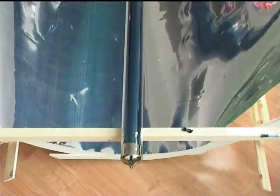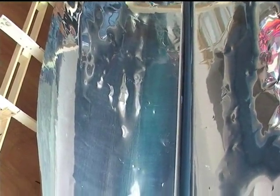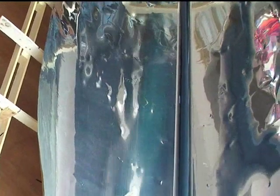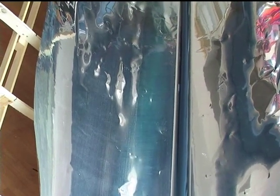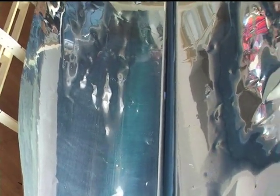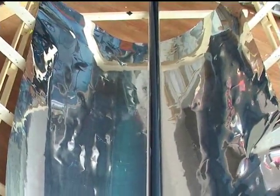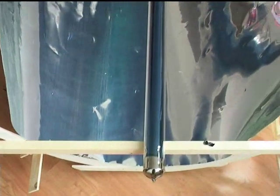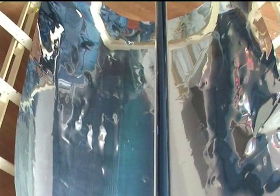I made support for the vacuum tube and here I can show you that the mirror is actually focusing on the tube. Because here on the left side where the mirror is curved correctly, you can see mainly the vacuum tube — the blue of the vacuum tube — which means that the parallel rays of the sun will focus on the tube when they come down. So now I have to make the support and the attachment for the vacuum tube, and some kind of way to make it possible for the whole mirror to turn with the sun.